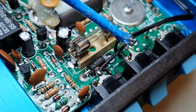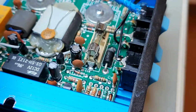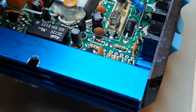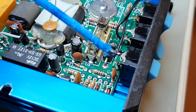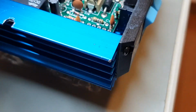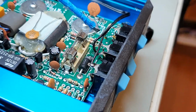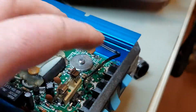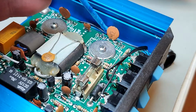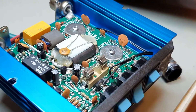to the negative terminal on the middle switch, and it's at the bottom. All right, here we go, that's a better one. So I've pre-tinned and then soldered it to the bottom. That's the positive. The negative you're going to solder to the top of the first pin, which is an open ground, which is there on continuously on. And that's all there is to it. And then tuck the wire out of the way. And I'm going to just put a tiny bit of wax on that, and it's going to be done.